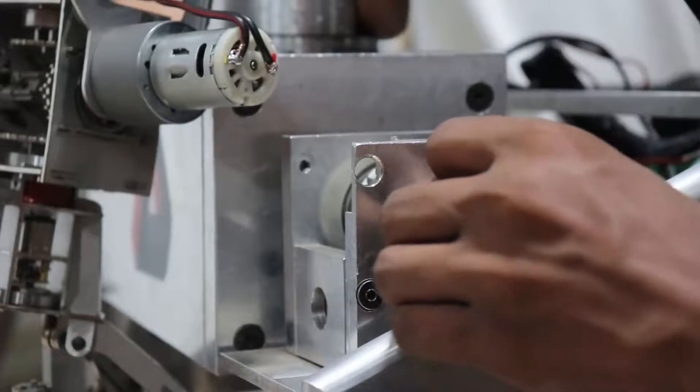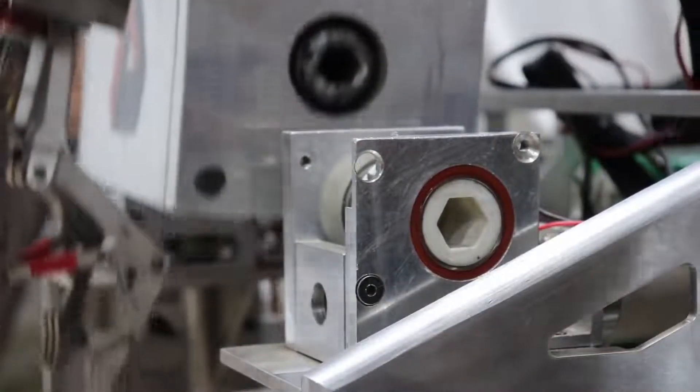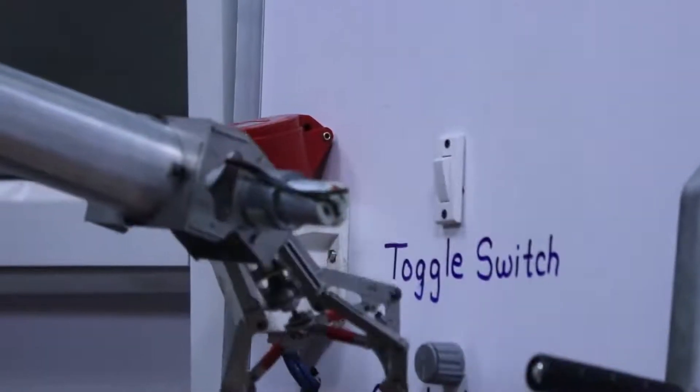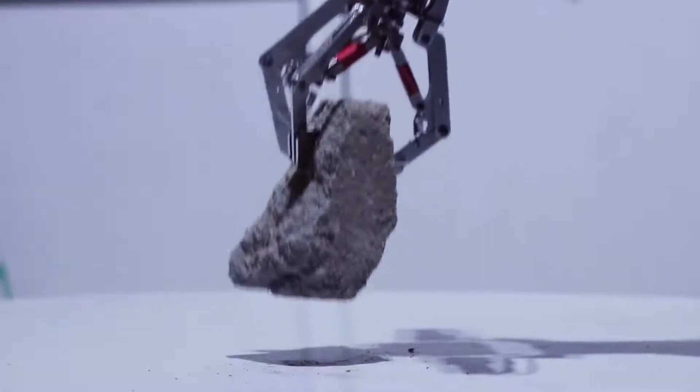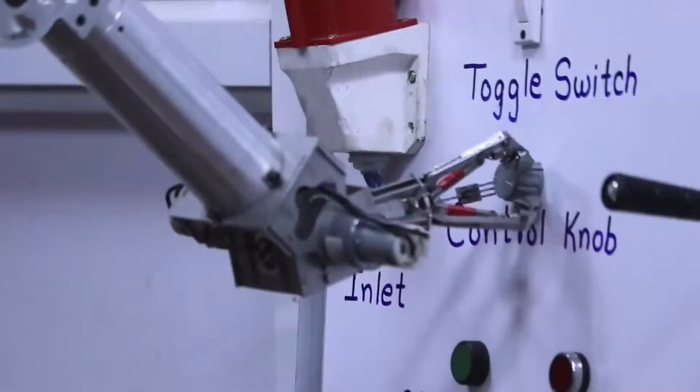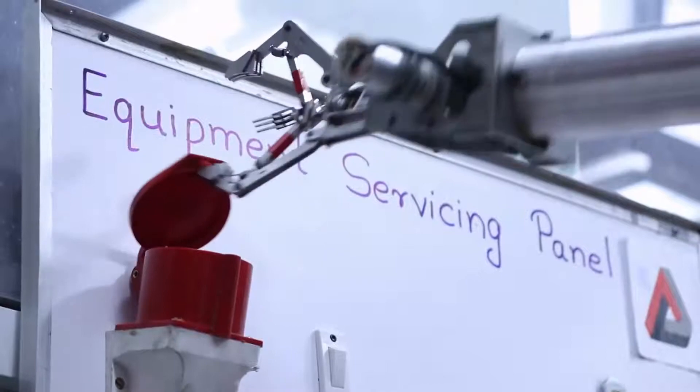With the vision of modularity in mind, we have made the entire arm a replaceable module which can be swapped out within seconds. The end effector is capable of holding objects of different shapes and sizes, and combined fingertips ensure a firm grasp, overcoming mechanical disturbances and backlash.